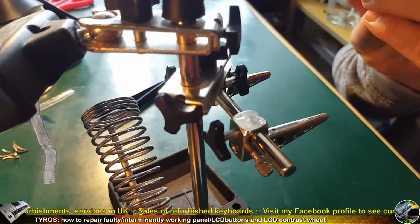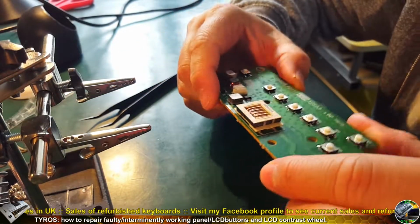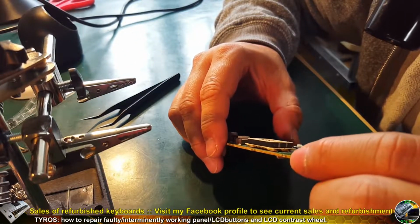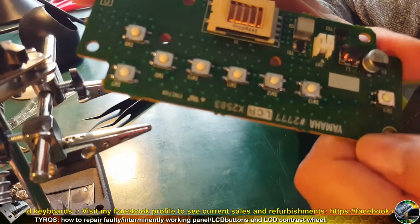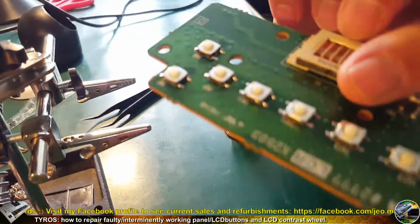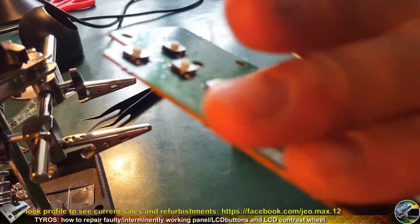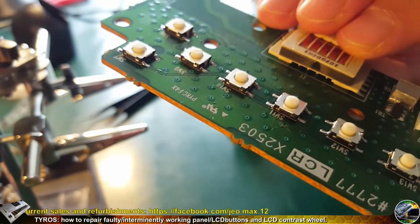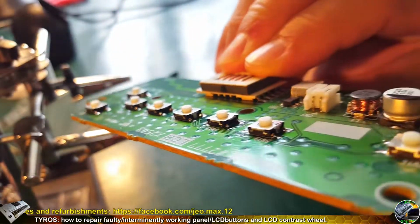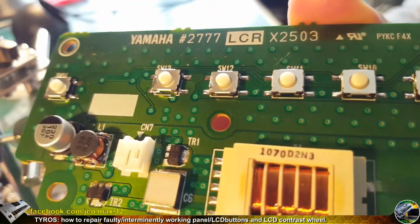And now visual inspection, if everything is okay, because sometimes it happens, especially when you use the microscope and you use only the top view, so you've got just one angle from the top, so you might not spot the incomplete joints. Incomplete joints is when you touch both elements but solder comes only to one of them. For example, the soldering part is only covered with the solder, but the terminal is clean, is out of the solder. So looking from many views, many angles, allows you to spot such kind of bad joints. Now in this case everything is fine.